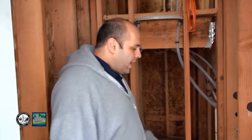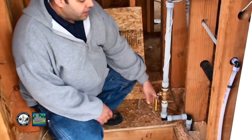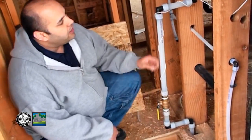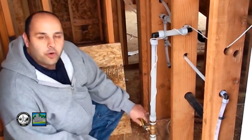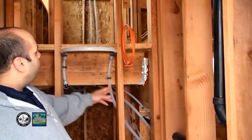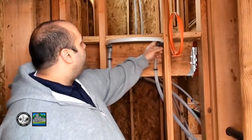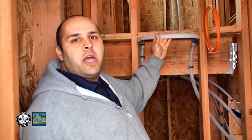We're here in the utility closet. We have our house main shut-off valve that comes into the residence. This is a full-way, full-port ball valve that allows the water to come in from the street main, from the meter outside, into the residence. This controls the water so if we have a problem we can shut it off right here without having to run out to the street. Up here we've got our water heater loop — cold water comes in to feed the water heater and then hot water goes out. Because we have to test both sides of the system, they make a loop so we can tie the two sides together and fill both sides for our test.